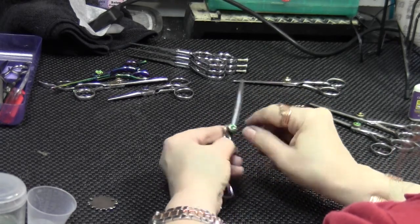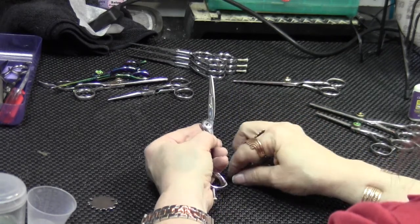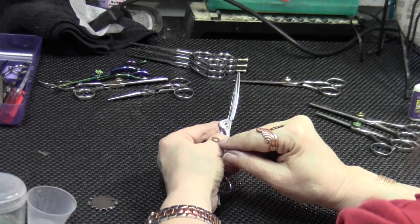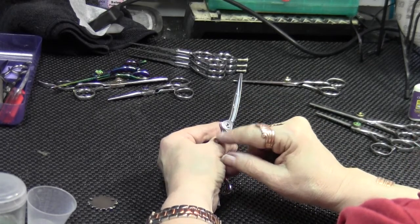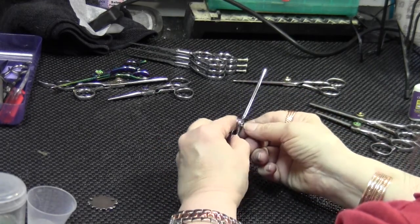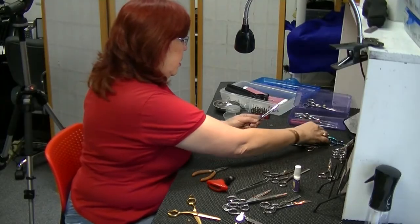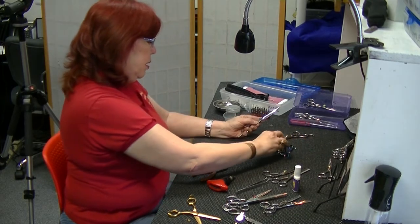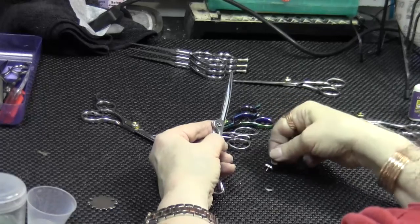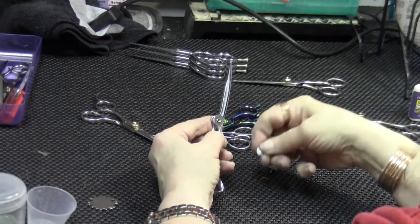When the nut comes off, see, it has a peg in it. There's my external clicker plate. Looks a lot like the internal clicker plates, doesn't it? And that same style is probably used as an internal clicker plate on some shears. And you see the bell washer? You'll see these bell washers sometimes on these leaf type shears, these leaf designs. What it does is hold the spring that holds the thumb nut on a little bit tighter, because it gives a little bit more cushion to it.